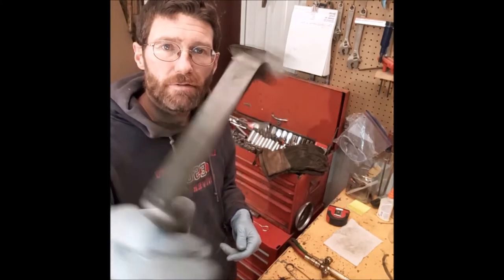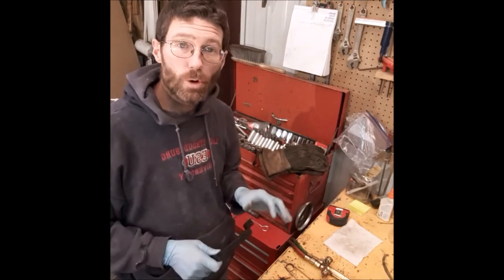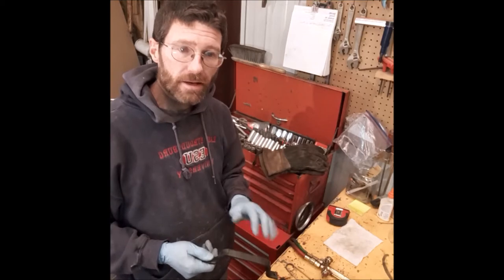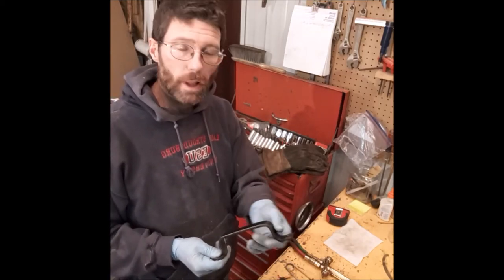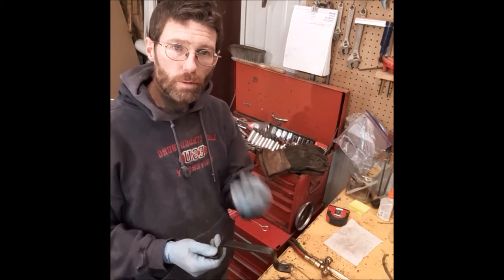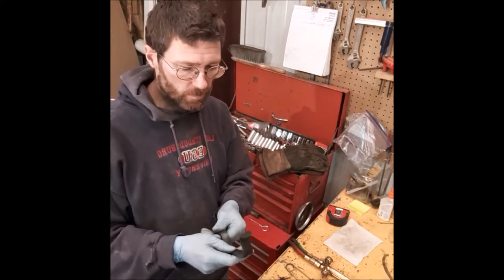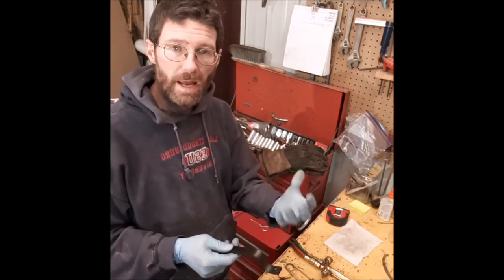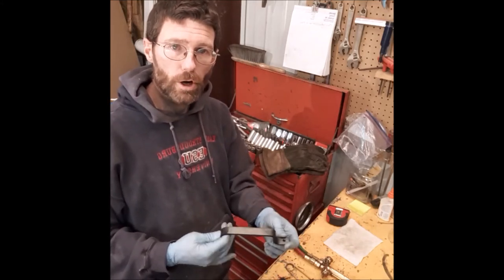To get a blackened finish, you have to heat it up, and you have to use some boiled linseed oil. And I put a little black color in it. While it's hot, you rub it on there and it'll blacken the metal and it'll dry on the metal. Okay, it's similar to a paint. It's not paint, but it'll bake right into the metal from the heat. It dries the linseed oil right onto the handle.